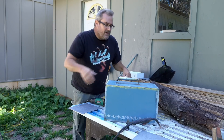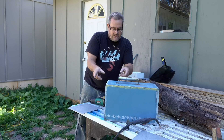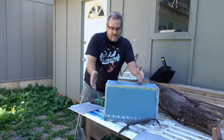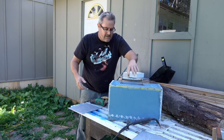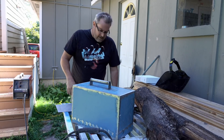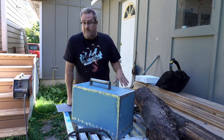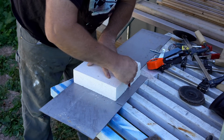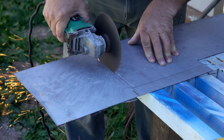Not the prettiest looking thing, but it does work. I offset the handle towards the front to make up for the extra weight and length of the door, so when I lift it up, it'll be balanced. What I'm doing today is making the door for the front. I took what was left over of that piece of sheet metal and used the bricks themselves as a marking guide to mark out the front panel, then just cut it out with the grinder.